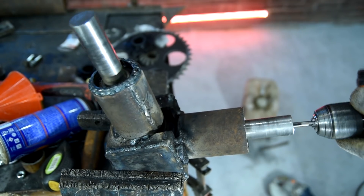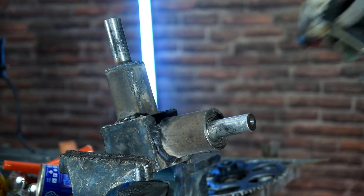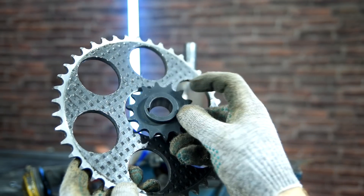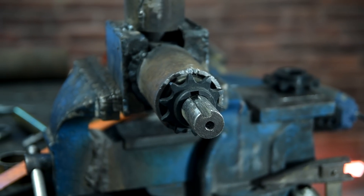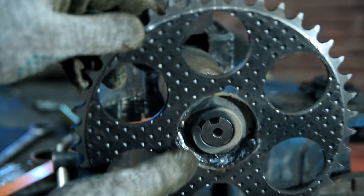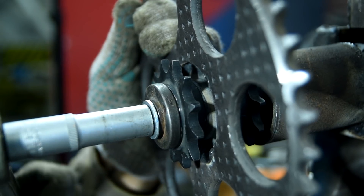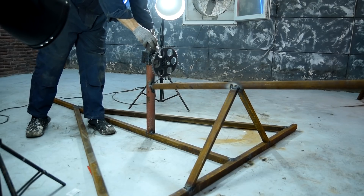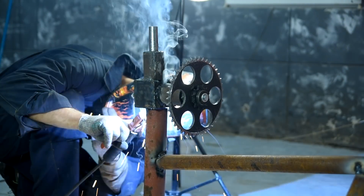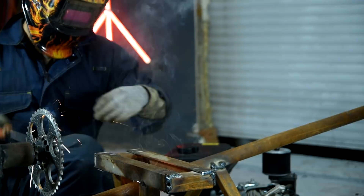This is how the rotation will be transferred to the propeller with a reduction of 1 to 2. We need to attach a sprocket on one of the shafts. I want to transmit the rotation to the angular gearbox from the engine through a chain. Additional sprockets will be used as spacers — it's also possible to attach additional equipment such as a generator to them. The reduction gear case will become a connecting link of the two parts of the girder. I'll weld its case to the earlier welded pipe and put the platform for the engine nearby, then try it on.